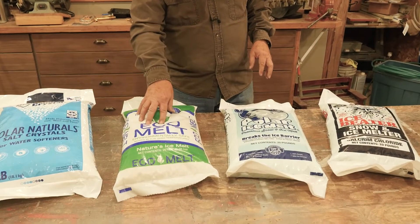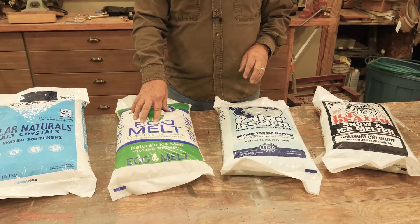Eco Melt has no coloring but it does have magnesium chloride. Let's talk about magnesium chloride — it is a salt, and you'll see it used a lot in municipalities. Here in the Mountain West, as snow is predicted and the snow front is coming into the area, the trucks will be out applying. The snow plows will be applying a magnesium chloride spray or brine to the surface of the highways in advance of the snow. Then when the snow hits, even if it's a heavy snow, it doesn't allow a bond to readily form between the snow, ice, and the concrete surface of the highway. When the snow plow trucks come back through, it shears off without leaving areas of black ice. So there's a tangible benefit to putting magnesium chloride in a product — that's what both Eco Melt and Polar Ice Melt do.